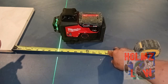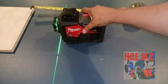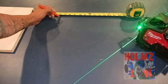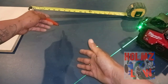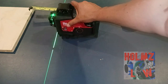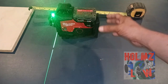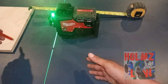At six inches, and then you come along to the farthest point possible on the other end and mark it at six inches as well. Now you have two points. If it's a really large room, you might want a third mark. You'll then position your laser and make sure it lines up with your two or three marks as best as possible, so your laser is square and straight, lined up with your wall.